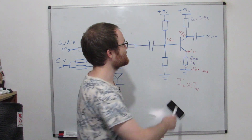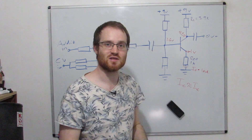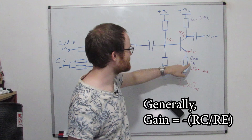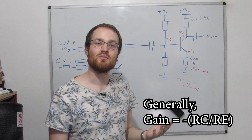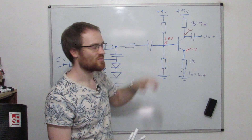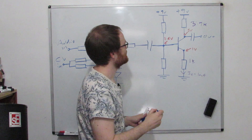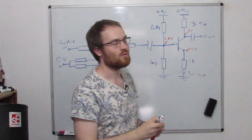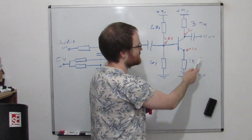It's a gain of minus 4 in fact, because as the current increases through the collector resistor and we're taking the output beneath that resistor, the output voltage drops. So if the base goes up by 0.1 volts, the output here goes down by 0.4 volts. We picked this ratio for the resistors, but we haven't picked the actual values yet. To divide the input signal down, I'm going to put 47k and 10k in the bias divider.